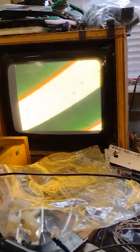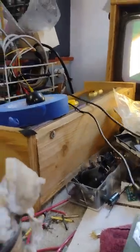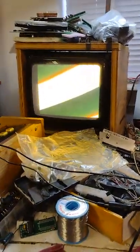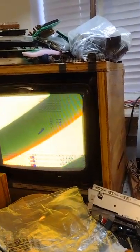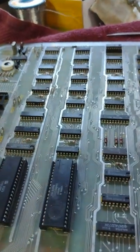That doesn't look good - we have random garbage on screen. Let's see self-test - self-test is doing nothing. Check the reset - reset's not happy. All right, that's step one, we got the clock working. Now I've got to probe around. Self-test is running - it's giving me a ROM 4 error. All I did was reseat the CPU chip and that got it running.